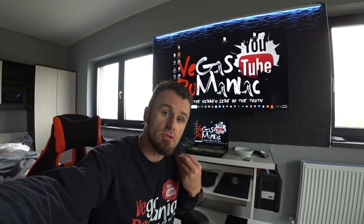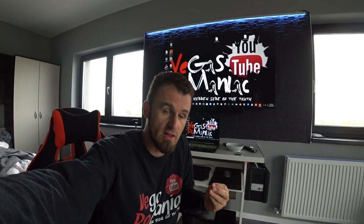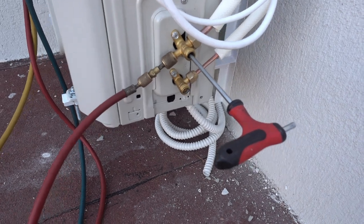I really really wanted to do it without pulling a vacuum because I didn't have a vacuum pump. I struggled and researched and watched all those Hindi videos about using the compressor on the unit — but you just cannot do it that way because there are two valves that are closed and you simply cannot pull a vacuum with the unit's compressor.